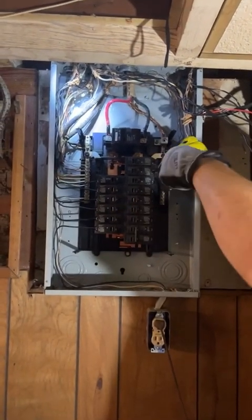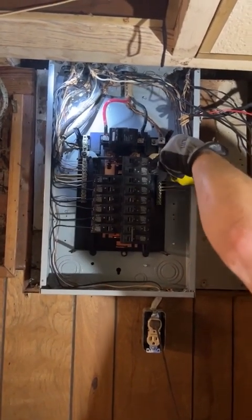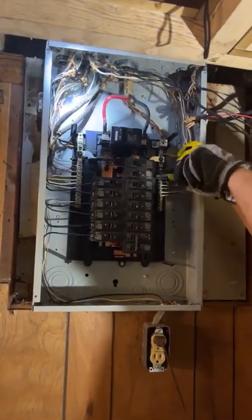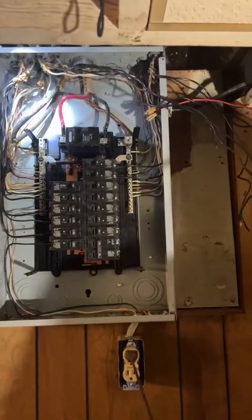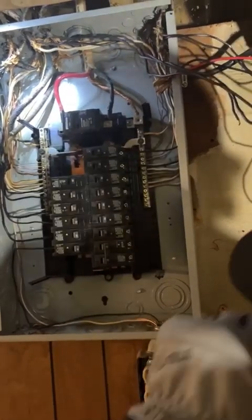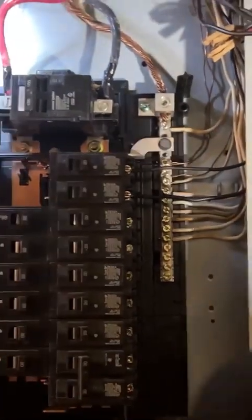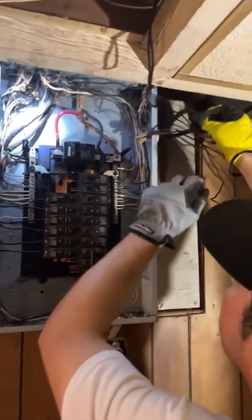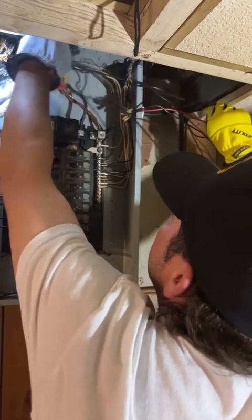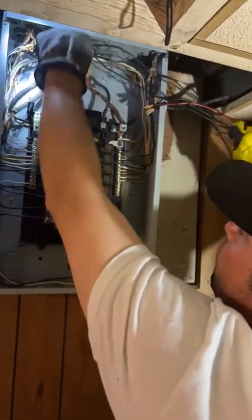When you're doing these, you don't want barely any wire sticking out the back of a breaker — just in case there's a flying ground somewhere, you don't want it to arc out in there. So you want to cut it exactly. Oh, here's a short one — I probably should have used this first, but we're going to get the wire stretcher out.